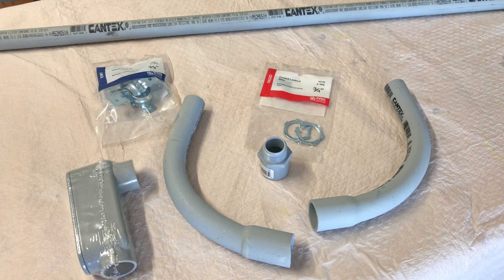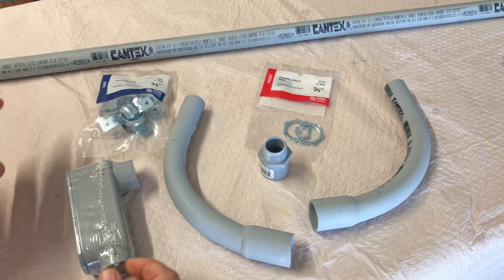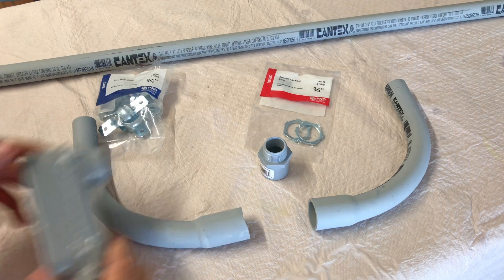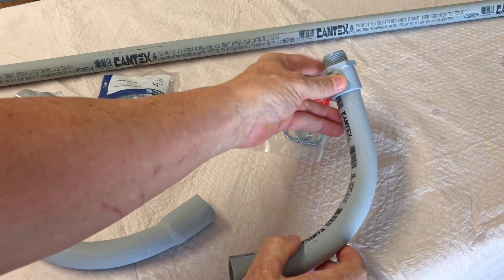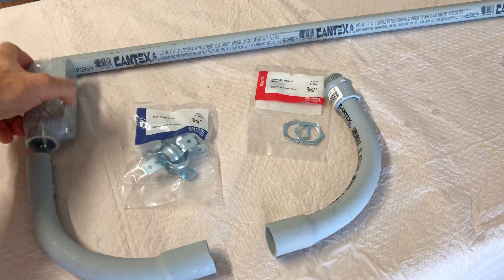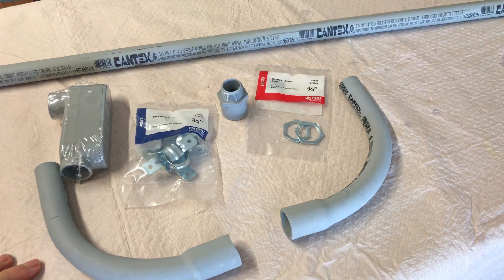I'll list all the parts in the description if you want to try a project like this. Just a reminder — I'm not an electrician, so use this information for ideas and don't rely on it a hundred percent. I picked up a five foot piece of three quarter inch schedule 40 PVC since I didn't need a full ten foot length. Some of these joints won't be done perfectly — I went with simplicity since it's a very short run, so pulling wires through shouldn't be a problem. I have an LB PVC connector that will be glued to one end going into the wall, and a connector on the other end screwing into the knockout on the bottom of the box, with a piece of pipe in between. Next I need to get out there and put this together to determine exactly where I need to drill the hole from the outside to mount the LB.